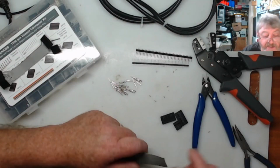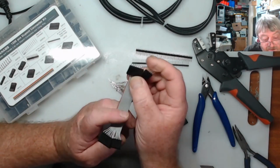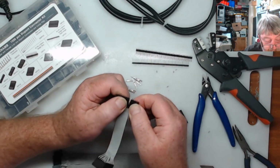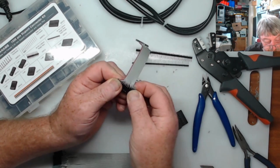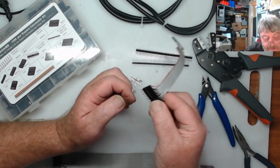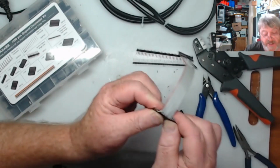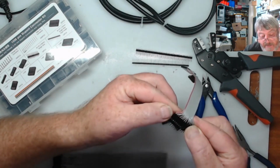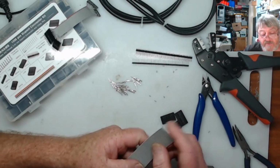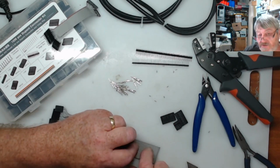So what you can see is I've done the first cable. So these are the male ends, and the way they go into the board is they're going to be a little bit close. So what I've done is I've put them into header connectors to go into the board. So that'll just insulate and stop them shorting. It makes them the right width for the board as well. I'm going to do the same with the keyboard end.